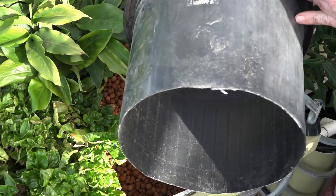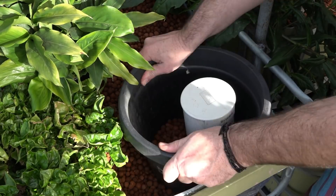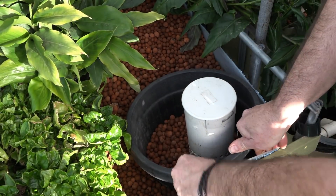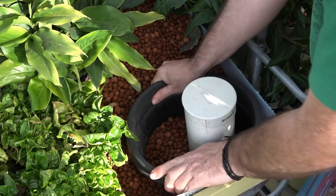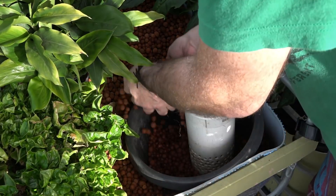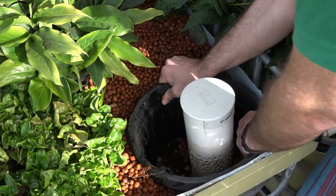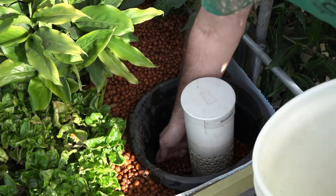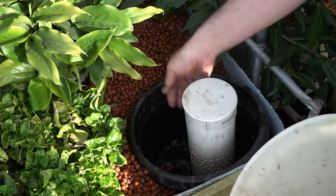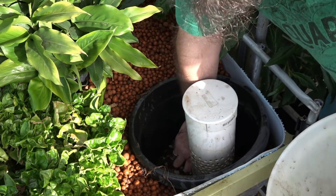What I'm going to do is use this flower pot with no hole in it. I have tried to use a square bucket, but with these flower pots, because they're circular, you can sort of twist them backwards and forwards, and it's a lot easier to get them down to the base of the bed. I was going to use a square one, and then I remembered it's just a lot easier to twist these things in. So we'll just move as much as we can around the outside, get it down a bit further, and the rest of this clay can come out just into a bucket. That will give me direct access to the base of the bed, with no clay getting in the way of removing the old uniseal and putting in the new bulkhead fitting.